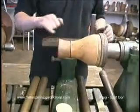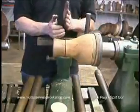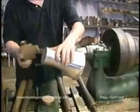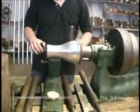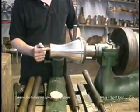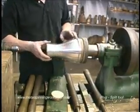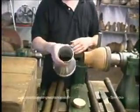Once the two parts are together, we get the outline of the actual shape that we need, but it has to be split at the narrowest diameter of the shell. So if we take this, and I'll set it up how it was before I took the nose out, I spun down all the way to the end. I then came around to the front and cut the nose out. That meant, because there's a split right here in the tool, I can remove the shell and then simply knock out the nose.